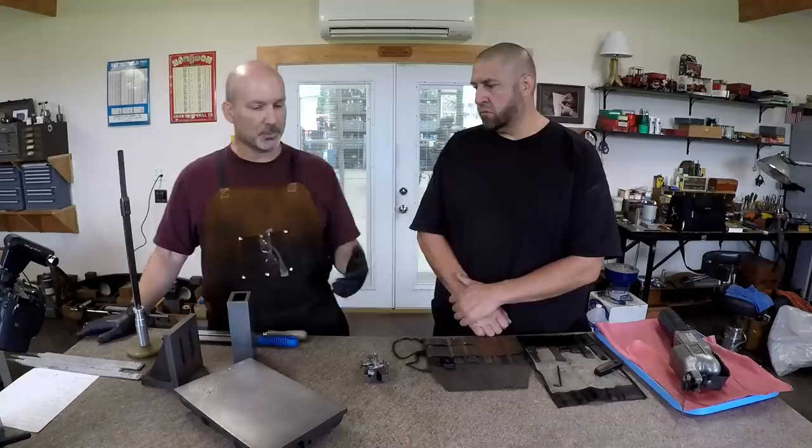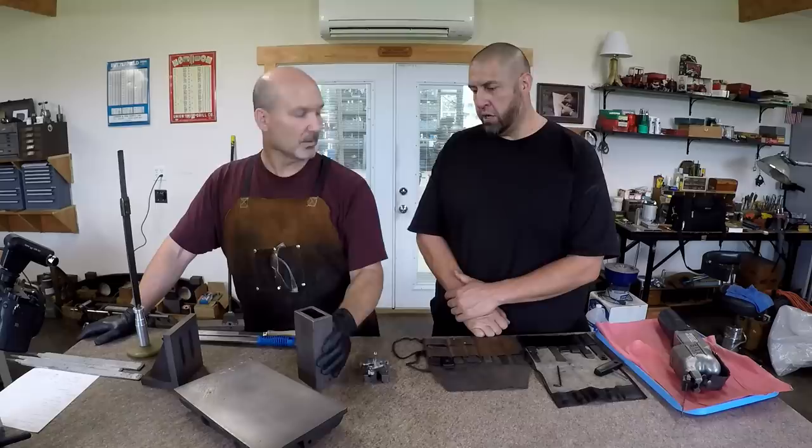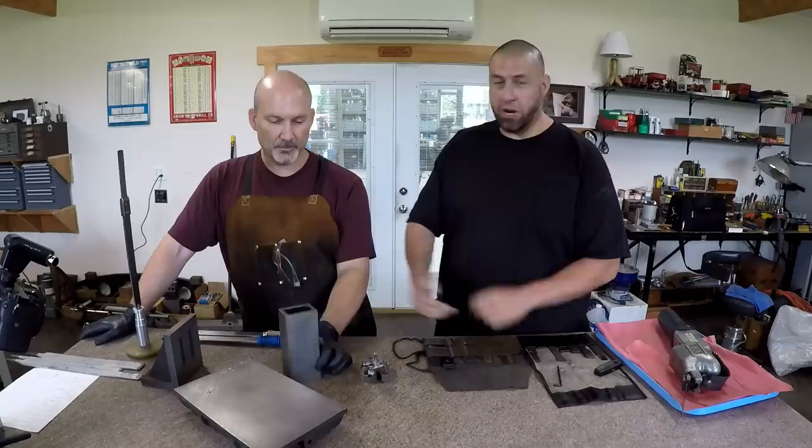The other reasons are machine tool repair or making measuring devices or reference pieces like this box channel. Yeah, that's a tunnel block or a tunnel square or a riser block, but that's something that you would typically use just to make a riser block. Like a setup block. But Lance has scraped it in within 2/10.